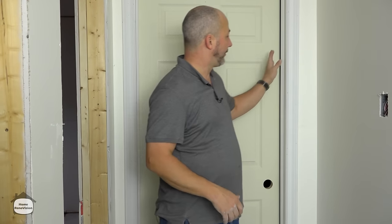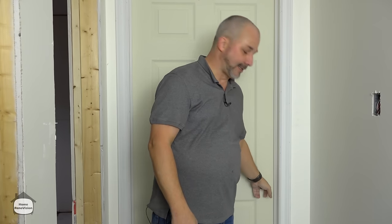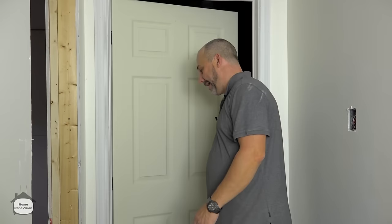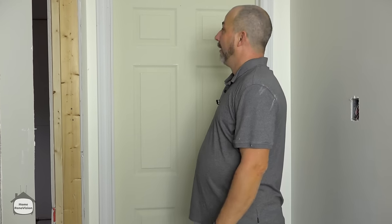Now, that covers all three systems. The cheapest turned out to be the most tedious. But if you're comfortable with using a miter saw and measuring it and slapping them together like this and your hole's the right size, this is also pretty quick. What I would suggest is if you're a door slammer type family, this is not a good system for you unless you got casing on both sides. But since it's just going into an empty room where we have the furnace, really all we need here is something that we can paint and close off our gap so visually we can't see the furnace room. So that works great.